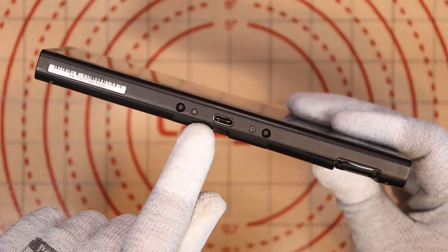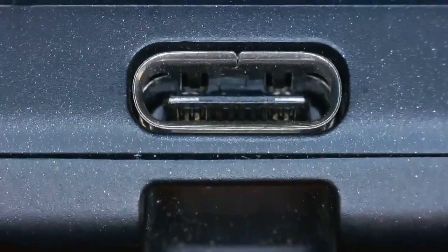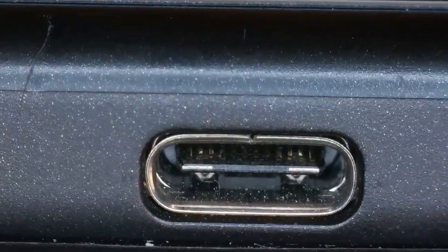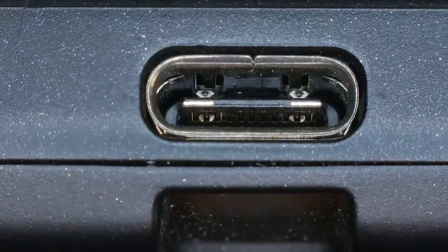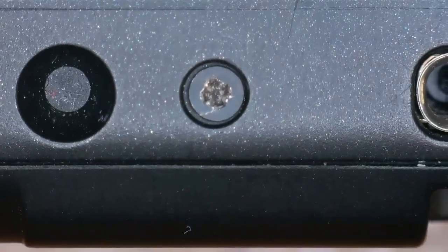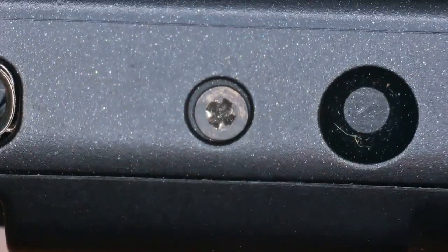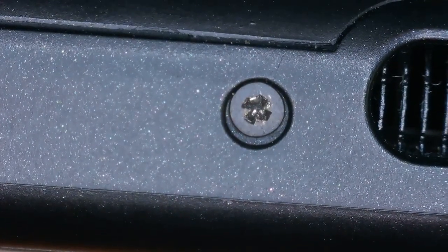Back under the scope to see how the charging port looks. We're looking for any bent gold pins on the top and bottom — and this port looks unbelievable. Factory clean, very little debris. However, one screw does look a bit stripped, and the one on top also looks stripped, so somebody has definitely taken the back off this console before.